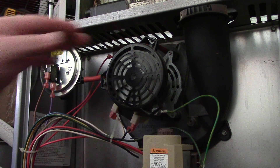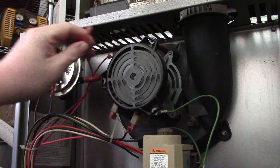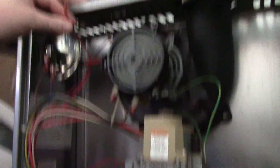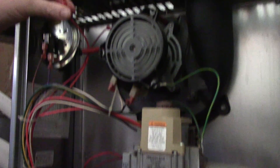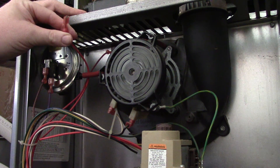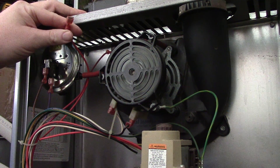Here's a demonstration of what I was talking about. If you go to troubleshoot and disconnect it — the furnace came on. That switch must be bad. The integrated furnace control, the circuit board down there, all it knows is it lost that 24-volt signal telling it everything is okay. I don't even have a call for heat, so it will just automatically do this.